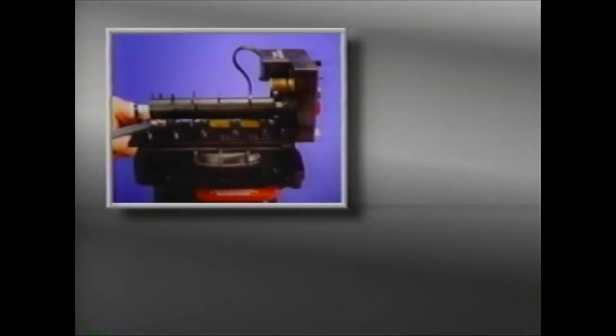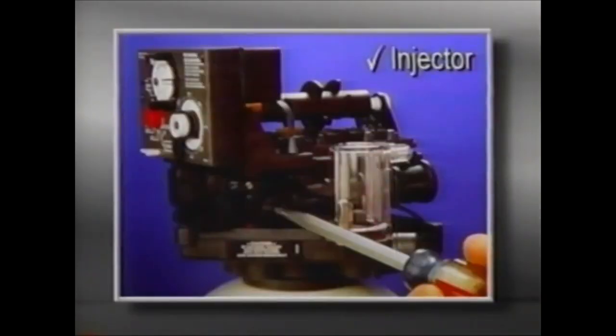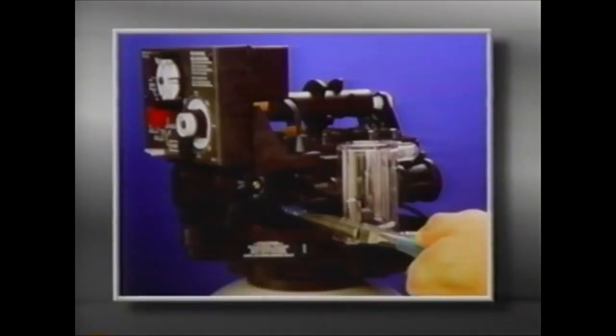To proceed with further disassembly, bypass or turn off the water to the valve. Then release the pressure inside the system by pushing on valve disc 5 or 6 with a straight blade screwdriver. Begin by checking the injector. Start by removing the injector cap with a large straight blade screwdriver or a torque wrench. With the needle nose pliers, pull the injector out. Make sure that it is not obstructed and that the throat of the injector is open.